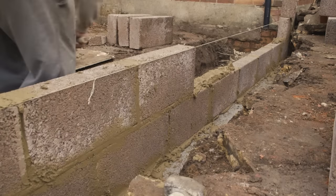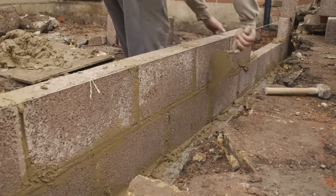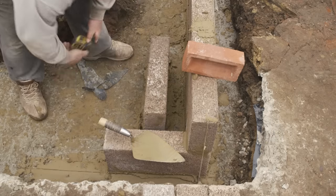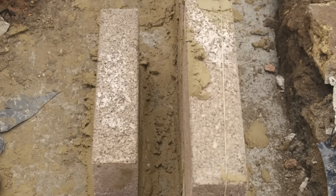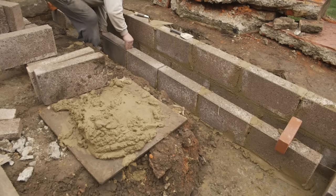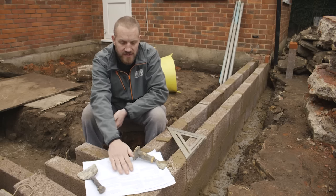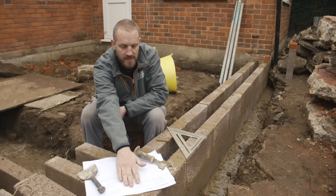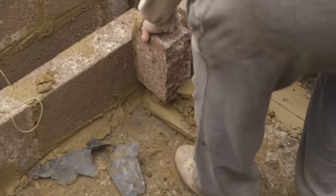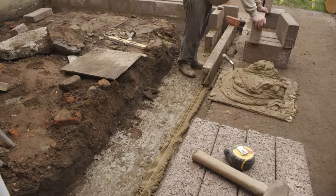String lines are probably a brickie's best friend — run it off the existing brickwork to your corner point and it gives you the top level for each course running up. We've got the inner and outer skin up in block work: 100mm blocks with a 100mm cavity, and we're going to put 50mm insulation tight to the inside skin. Referring back to the drawings, under 'new external cavity wall' it confirms exactly what we've done — 100mm blocks, 100mm cavity, 50mm cavity insulation. Stick to the drawings, stick to regs, and that completes the first stage of the block work.